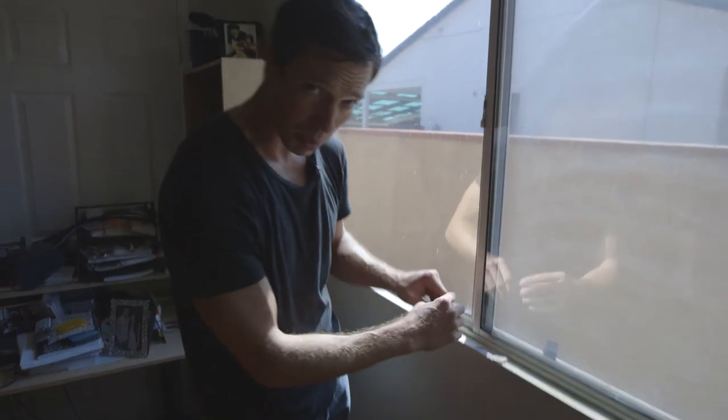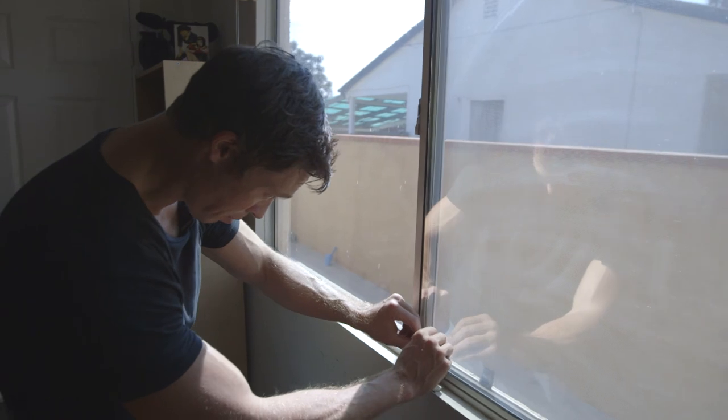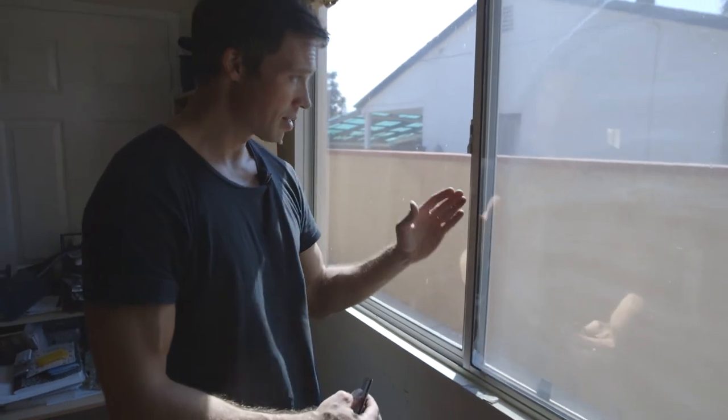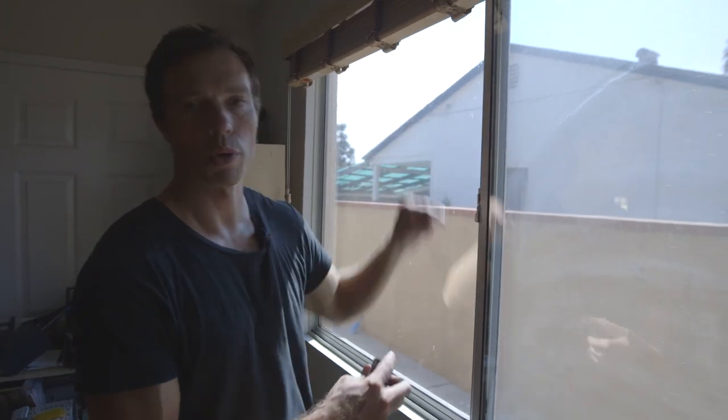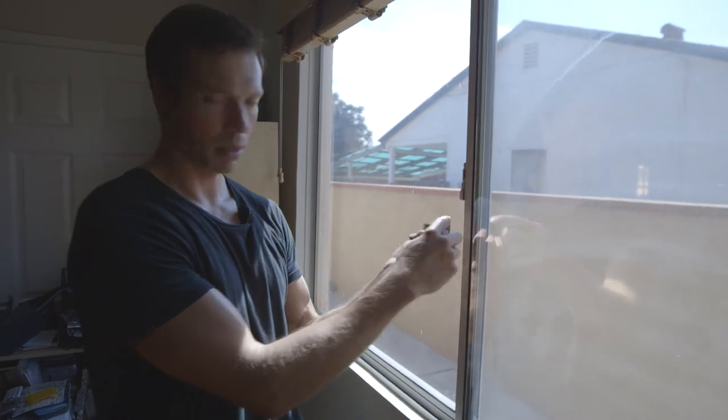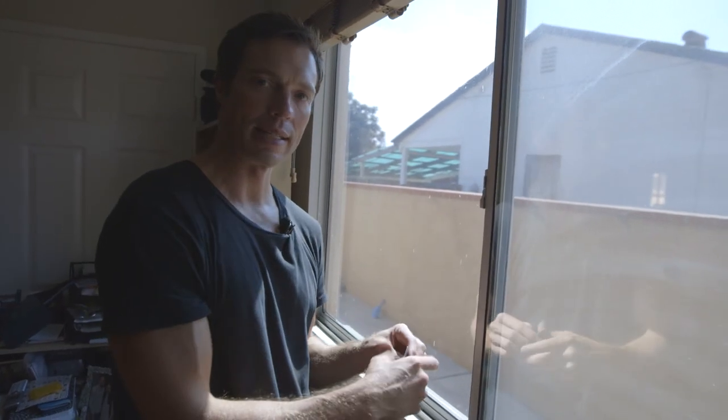And we had a little bit of a problem corner down here. This guy was being a booger. And these aluminum windows, these sills, they actually have a rubber seal all the way around them. It's kind of tricky to trim in and out of. Sometimes when you trim it, you have to peel the rubber back and stuff the tint in.